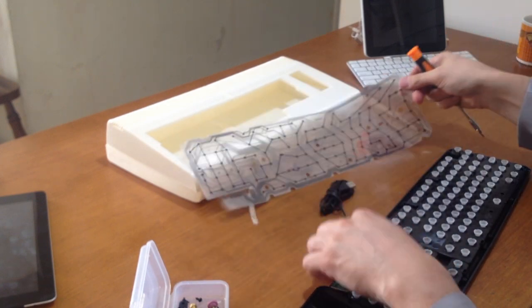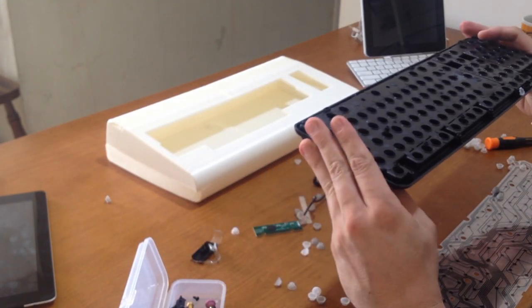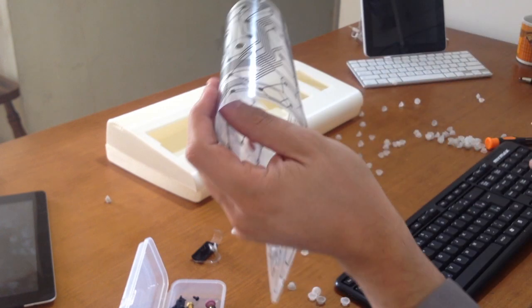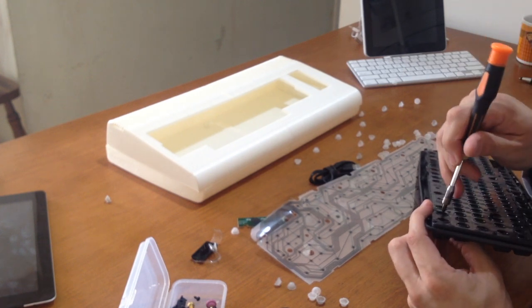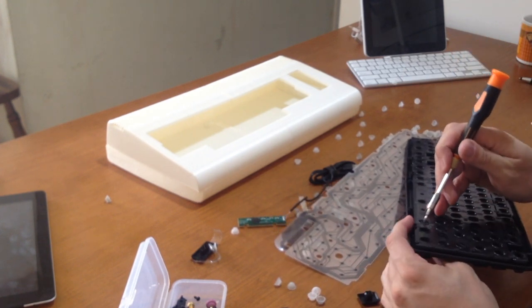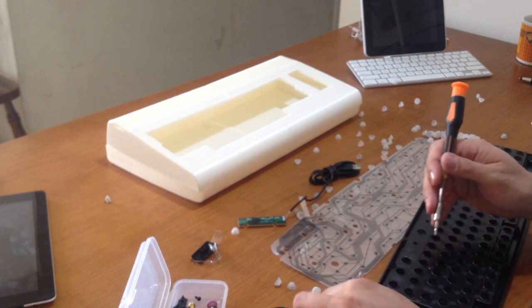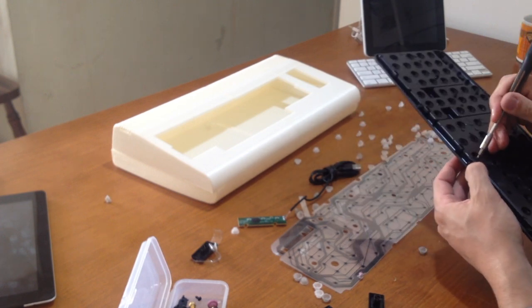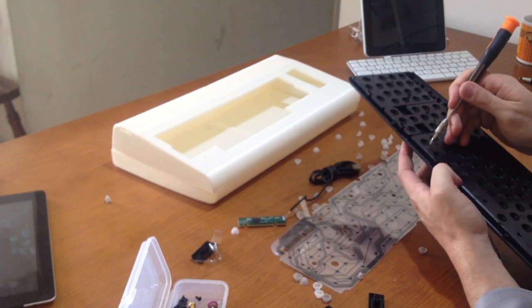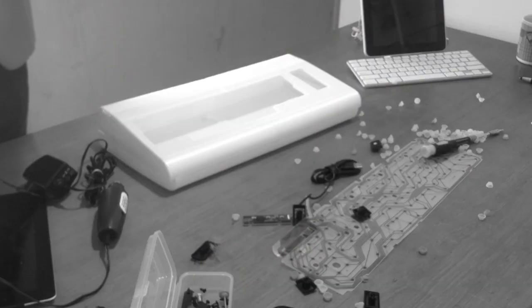Inside I found a membrane to use with the keys, and these silicone coins that spring back the keys. I just learned that this membrane is very prone to oxidize and lose contact. And the keys are also very simply made. I think that's how cheaper keyboards are made nowadays. At least this is just perfect to be used on this computer, because as we're going to see, they just fit inside this beautiful Commodore I printed out. So let's cut the parts we don't need.